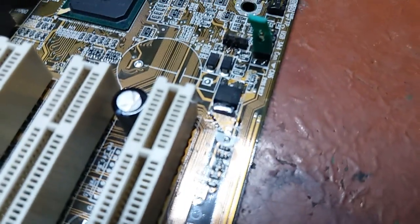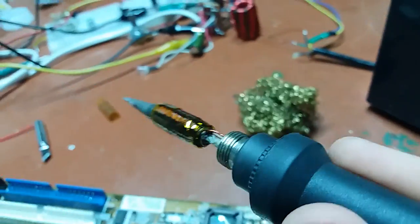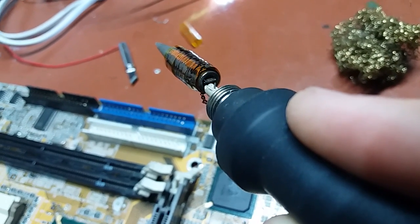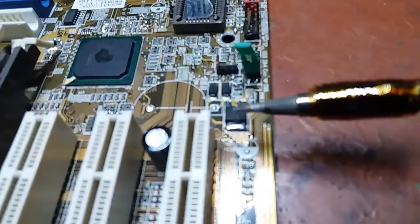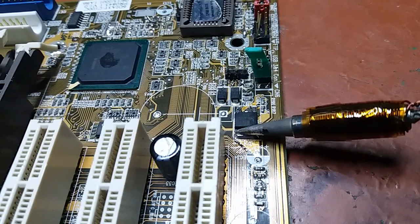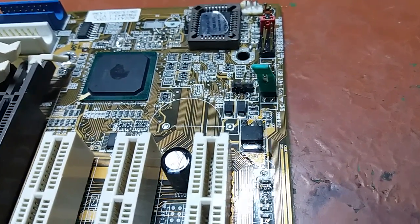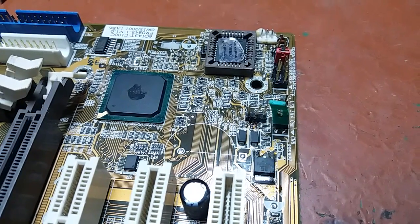It is inductively heated, so it's much better than usual stuff. I'm going to also show you how easy it is to solder this tab on this D-PAK package. Let me clean the iron. Right now the tip is held in place with a little shim I made from a tuna can, as you can see there. It's not great by any means but it works — it's a prototype. And we are melted — see.